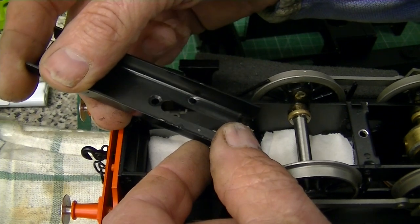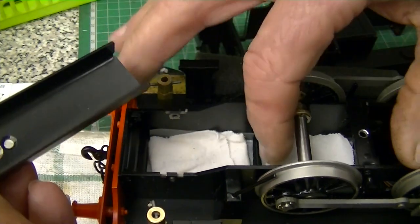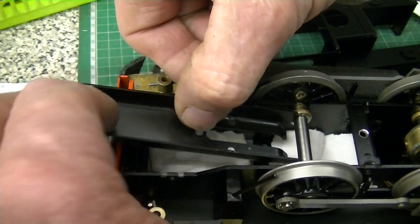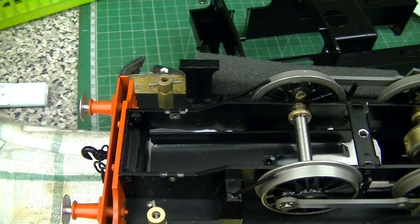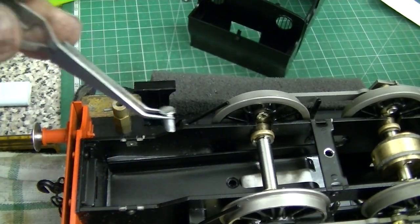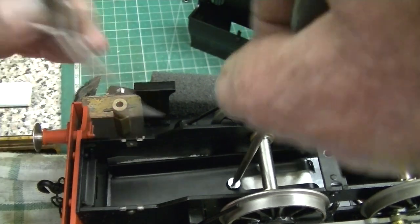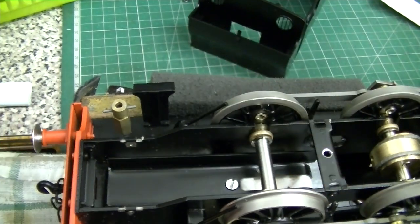This little fella that holds the battery is the battery support bracket, and it's actually going to go through that screw hole and mount just there. Some locos have a screw mounted in there — if there is one, remove it. We've provided you with a countersunk three millimeter screw and using your angled pliers you just screw the battery container firmly into place.